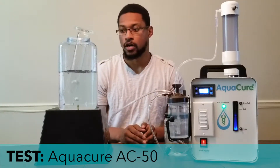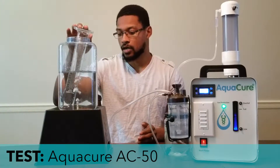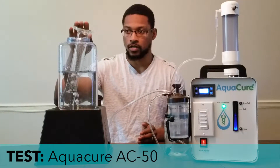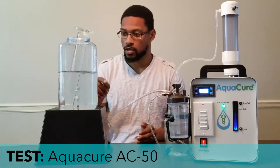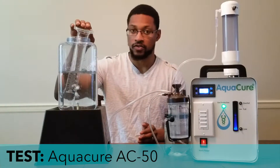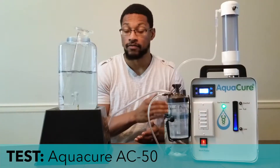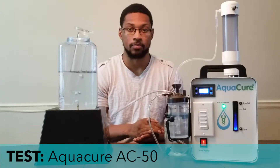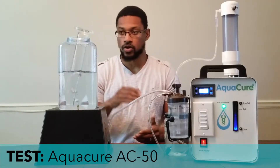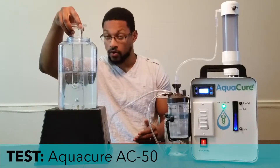What we have here is the gas displacement apparatus. How the test will be run is we'll go ahead and allow the gas production to fill the graduated beaker for 15 seconds, then multiply that 15 seconds by four to get a minute. That will give us an approximate milliliter-per-minute gas output for the device. So let's go ahead and run the test.